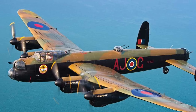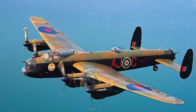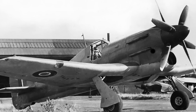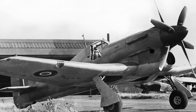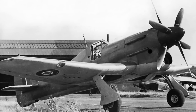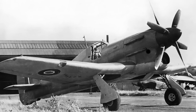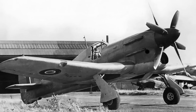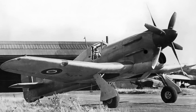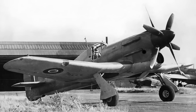The Manchester was redesigned with four Merlin engines and rebranded as the Lancaster — originally known as the Manchester 3 — which went on to become one of the most successful bombers of World War II. Production versions of the Warwick ended up using Pratt & Whitney R-2800 or Bristol Centaurus engines. Although about 1,760 Hawker Tornadoes were initially ordered, only three Vulture-powered versions were ever built before the Napier Sabre-powered Typhoon took over. By September 1942, the sole production Hawker Tornado R7936 was fitted with a Vulture engine using a contrarotating gear reduction to test propellers made by Rotol and de Havilland. Some reports suggested that one experimental Vulture had its bore increased by 0.4 inches to 5.4 inches total, matching the Merlin's bore, increasing displacement by 432 cubic inches to a total of 3,023 cubic inches, though no further documentation exists.